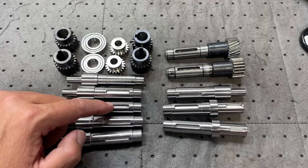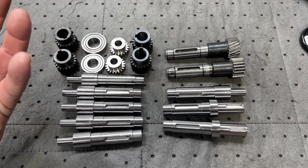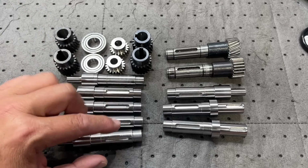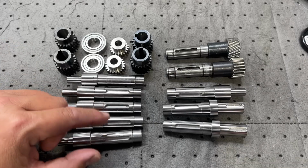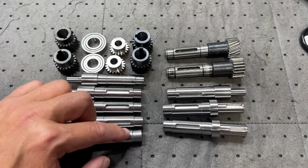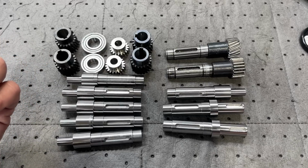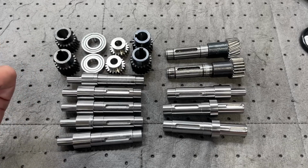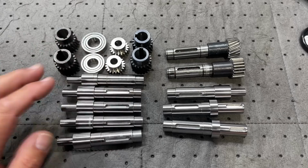So there were a couple of them that I didn't hit the size that I wanted. We were like a half a thou or even 1 thou under when we first started turning it, before we were adjusting our tools. So there were a couple of them that we just skimmed down a little bit more, trying to get the tip of the tool exactly where we wanted, adjusting the tool wear compensation. So anyway, just practice pieces right there.